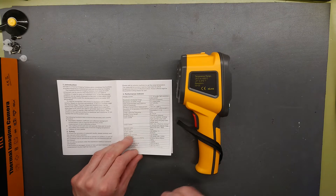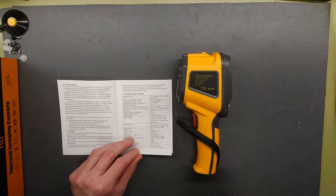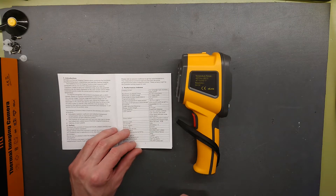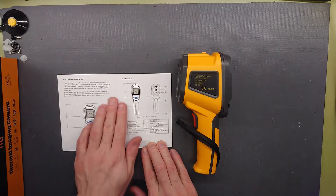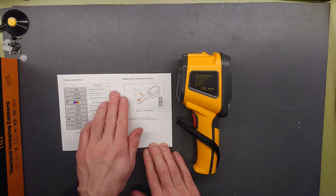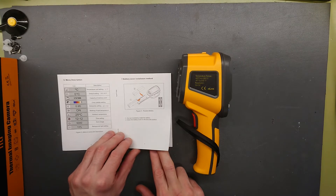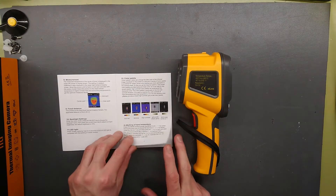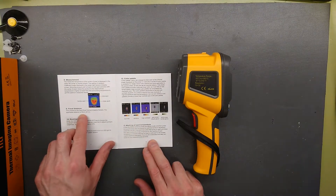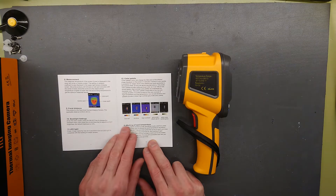What I did read about this is that it has problems with showing the hottest areas as red instead of going over into white as normally seen. You can also see the capturing frequency is 6 hertz, which is quite normal due to export restrictions on thermal imaging hardware being used in weapons — anything higher than 6 hertz is export restricted. And the focal distance: this is a fixed focal thermal imaging camera with an applicable distance of 50 centimeters.